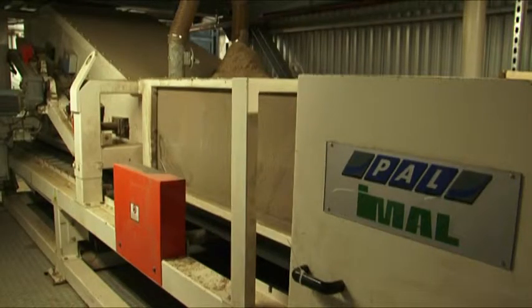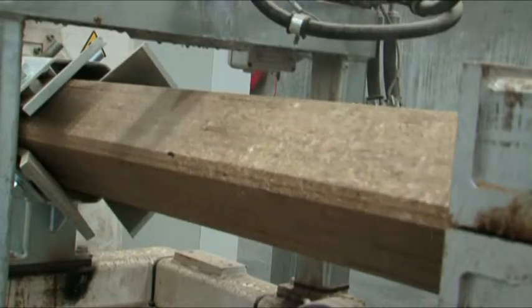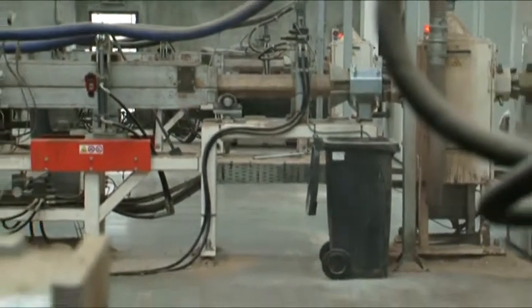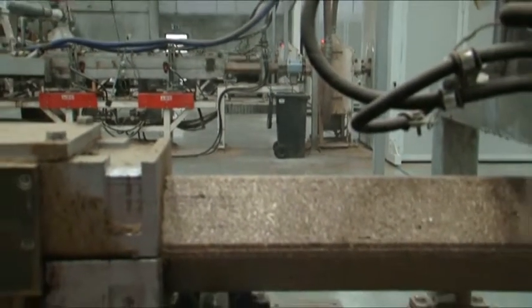After this, the material is conveyed to the press lines. The material feeds by gravity down through the metering system at the start of the press. The extrusion press has a pre-compressing chamber operated from the side and a single hydraulic ram from the back. The shape of the block being produced is determined by the continuous mould coming out from the machine.